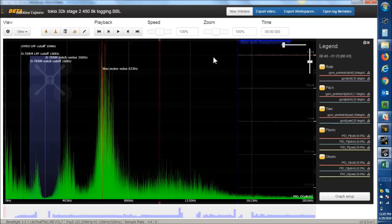One thing I wanted to add: that D-term spike — I don't know if you saw my previous video about the D-term spikes in Betaflight 3.3.0 and 3.3.1 — they are real. It's not a manifestation of black box recording. In my experience and others', they do heat up the motors and are now fixed in the latest builds of 3.4. It will also be in a maintenance release of 3.3.2, so if you want to stay on stable releases, when that one comes out do upgrade to it. Just do a diff, flash the firmware, do a reset, paste the diff into the new setup, hit save and you're off to the races. Those spikes are there and they are real.